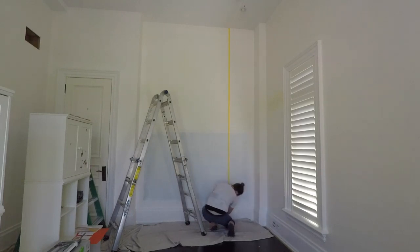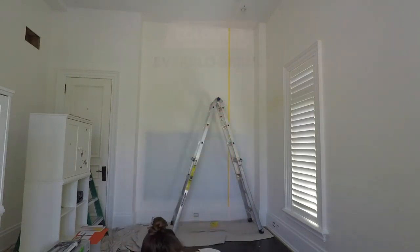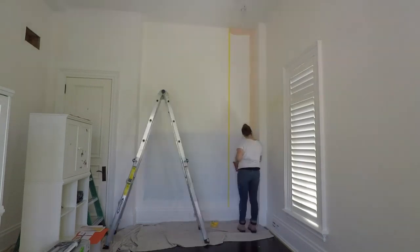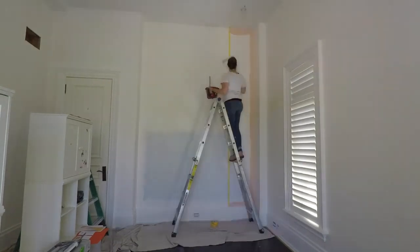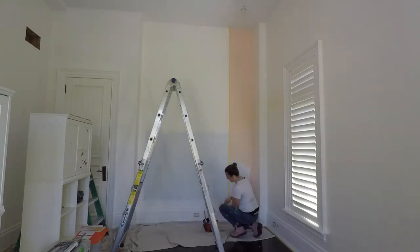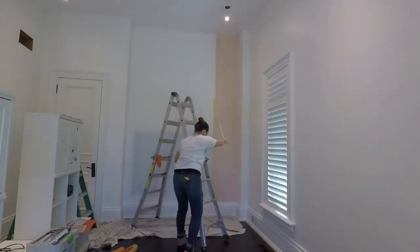Some of the paint had only dried for about an hour before I applied the tape. The first color I used is called Ever Blooming — all of the color information is listed in the description below. I used a 2-inch brush, which is just my personal preference, and then a 6-inch whiz roller which worked really well on these shapes because of their size. As soon as I finished rolling I was able to peel off the frog tape and I was left with a nice crisp line.